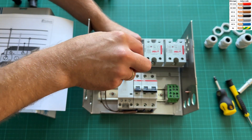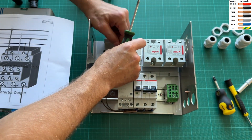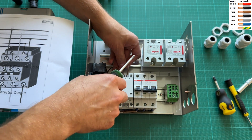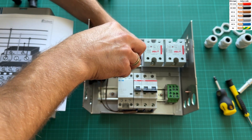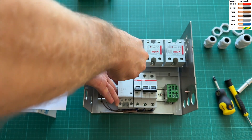The last two power wires in the relay switching circuit are connected as follows: one is connected from the fourth output terminal to the switching pole, and the other wire comes from the normally open switch and also goes to the switching pole. With this connection, the power side of the switching circuit is now completed.